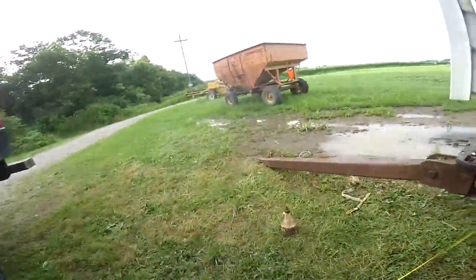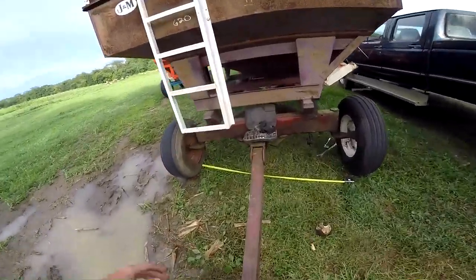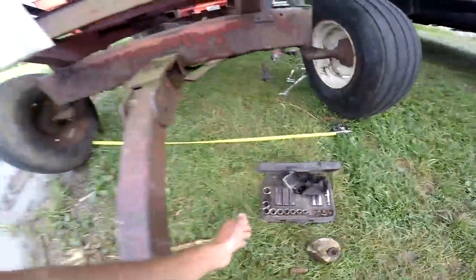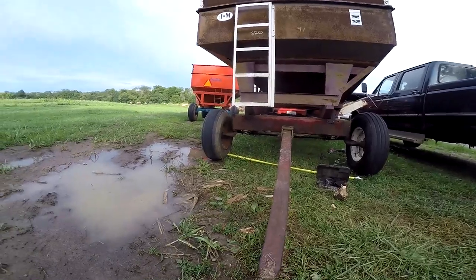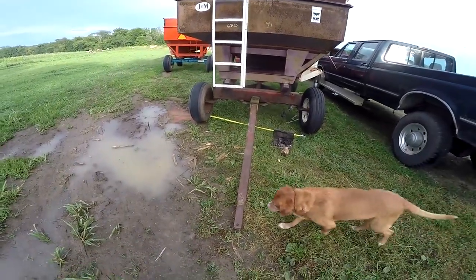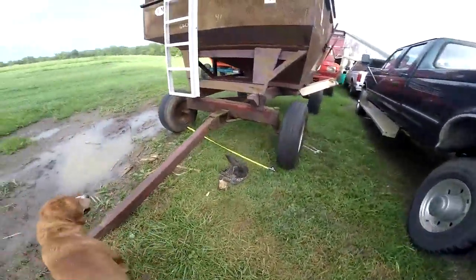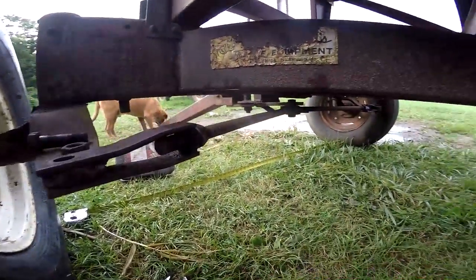I've already made some adjustment. I measured and both sides here on this clevis are equally out of adjustment. I set the tongue of the wagon straight as best as I could eyeball — we can look down the center pipe. Standing out here and looking straight, accounting for however much play there is in the hitch itself, that's pretty close. WD-40 was a big help; this hasn't been adjusted in a while.